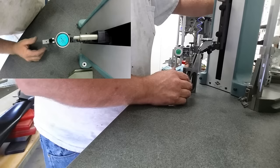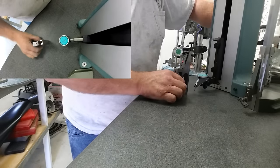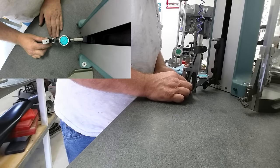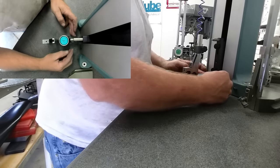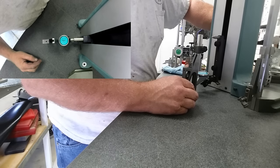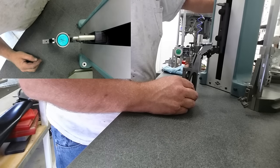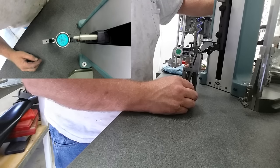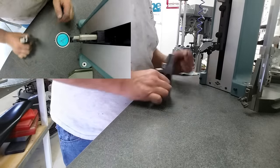It's about eight tenths off over that sweep — about a five inch sweep. Let's do it again and see if we get repeatable numbers. Just a shade below zero there. That was a better sweep — a total of three tenths. We started out a tenth below and ended up two tenths above. That's pretty good.